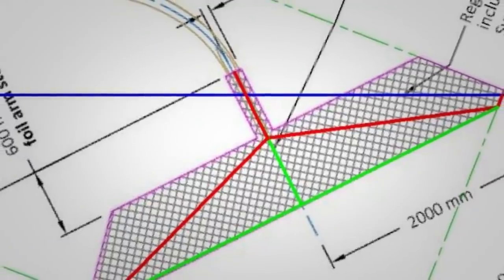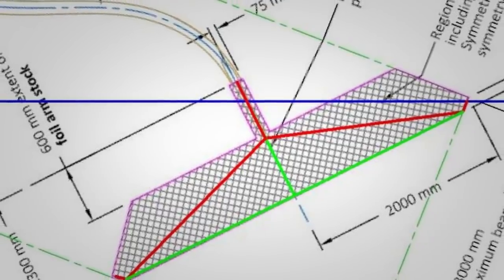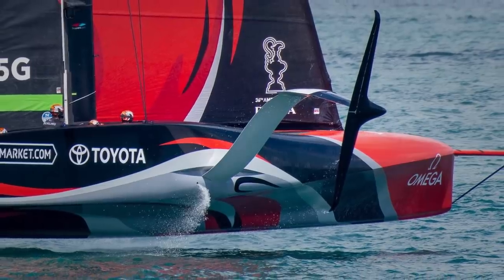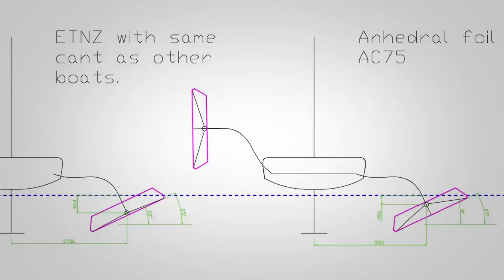I've got Tom Partington and Rob Gurnham with me to talk through what these shapes mean and what their purpose is. The T-foil in its simplest form has the lifting surface at the bottom of the rule box — it's basically a 90-degree intersect between the two surfaces. Team New Zealand are using a T-foil shape for their main lifting arm with very little anhedral angle. One of the key benefits of going down a T-foil route rather than a Y or W is that you're running your lifting surface much deeper.